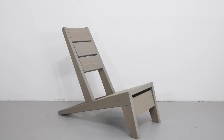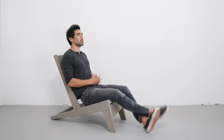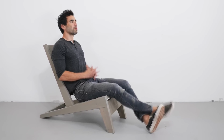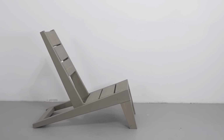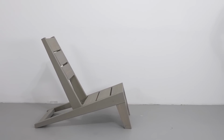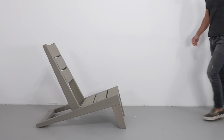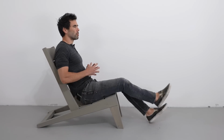I've used this triangular method of design and making quite a bit, and it's really easy, and the actual lengths of 36, 30, and 18 don't really matter. I just pick them so that I can remember them and pass the information along to someone that wants to make it exactly the same way. But what I like so much about this system is that they could be arbitrary lengths that don't fit on an even inch increment, and as long as you draw your triangles, you're going to get 2 pieces that are parallel, and then from there, make 2 sides and add some filler pieces in between.